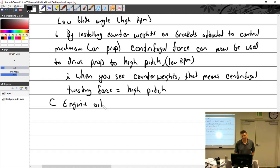Never know. So yes, it'll continue to windmill, and that's why we want it to feather. That windmill is drag. It's even worse if the engine is eating itself apart. You want to stop that. Think about an engine that's already lost a cylinder, with the crankshaft still going around and conrods bouncing back and forth. You want to shut that down, so you have to feather it.